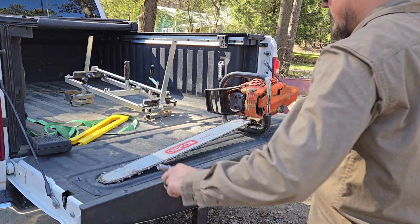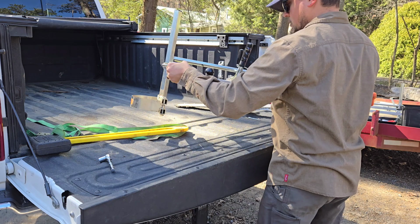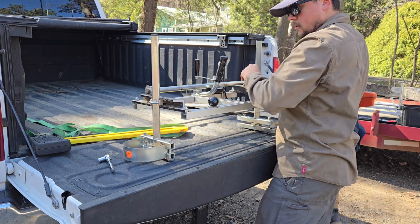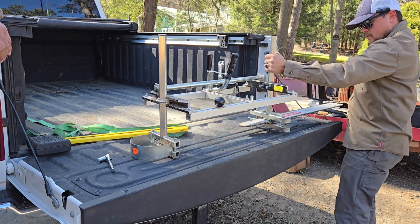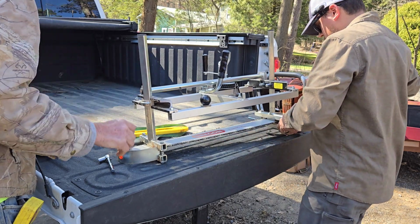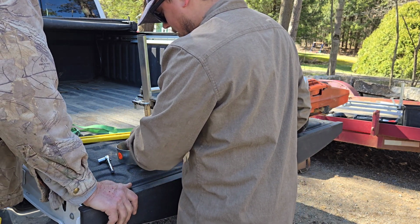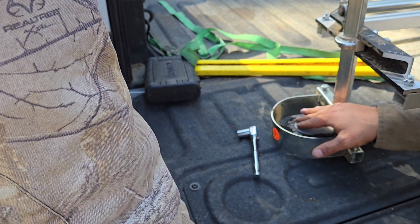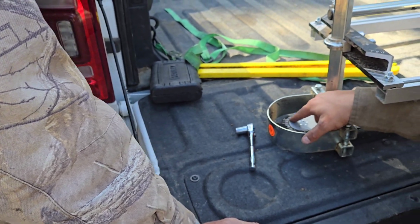All right, so I prematurely took my mill off, which isn't a big deal. Just gonna throw her back on. Watch out, Bubba. Not right there. If you go too far up here, it pinches that roller. Here, I'll show you what we're talking about. This roller right in here is just a roller with a bunch of bearings. There's a sprocket here. You have to grease it every time. And if you pinch that down, that's no longer going to let the chain roll free.